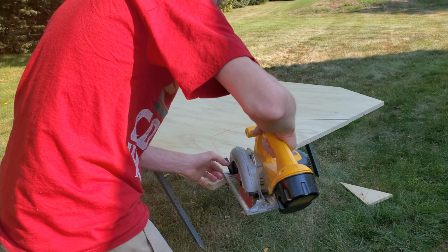With all that furniture fastened down, it was time to put the transom together. Now, we took our wood from yesterday that we had sealed up, and I've got these two pieces of aluminum that I had made, and we're going to clamp those together. Which is going to add a bunch of rigidity to that transom, so we're going to be able to put a larger motor on. Originally this only had that 9 horsepower motor on it, but with the new transom and the new plate that we made, we should have no problem putting a larger motor on here.